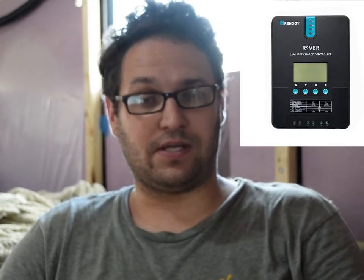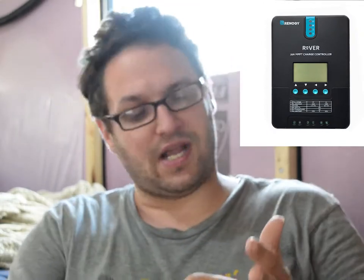The issue that I have with the solar panel kit in general is the MPPT — the actual company and kind of false advertising that they're doing. The MPPT is actually made pretty flimsily. The screws which you tighten the wires into for connectivity to charge your batteries are really shoddily made. If you over tighten it, you'll pop them. If you under tighten it, everything will slip out and there's no real sweet spot. You essentially have to get short wires, apply them to a board, and staple it down for it to actually remain inside.